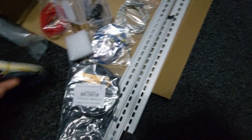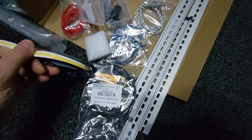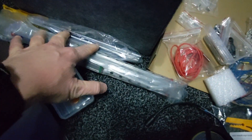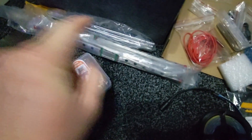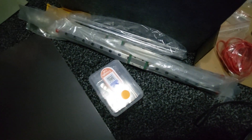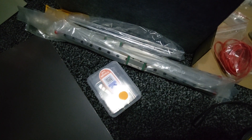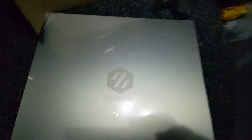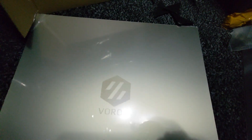I've got some LED high-density white strip, purely for providing a nice white even light inside so I can see what's going on. Also got linear rails and the straight rods. I haven't tried them for flatness yet by rolling them — job still to do. They stink of packing grease, and until I get some actual proper lubricant so I can clean and lubricate them and put them in the frame — which isn't here yet — there's kind of no point. We do have the magnetic build plate and the magnetic build bed from Energetic, who did put the Voron logo on for me — very accommodating. When you order on AliExpress, just ask them to do it. Sometimes they do, sometimes they don't.